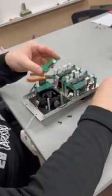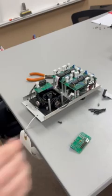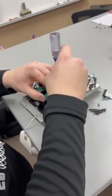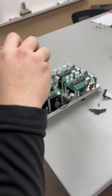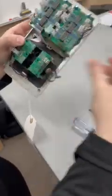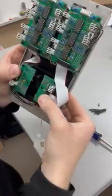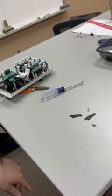Take your PCB and the same little black screws and reinstall it. Then plug your MTA connector back into the three-pin male connector, and plug your ribbon cable back into the module and back onto the SWAMP PCB. Now you've got a joystick controller with a floppy joystick — no return to center, nothing. You should only have these two plastic pieces and these two springs left over; every other part should go back onto the module.